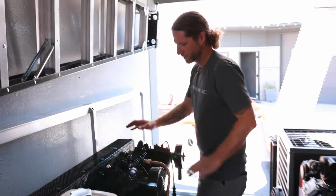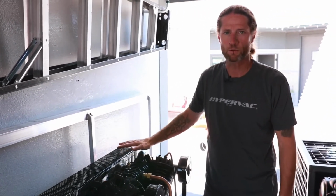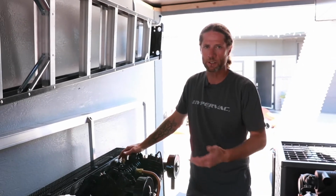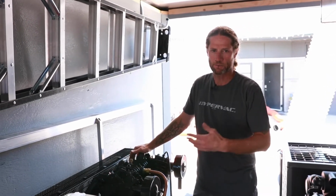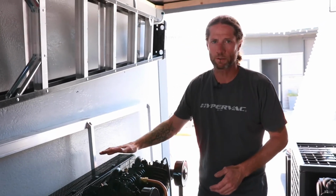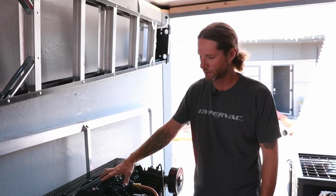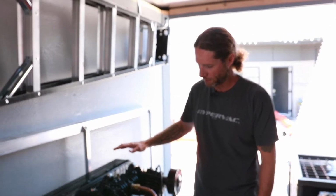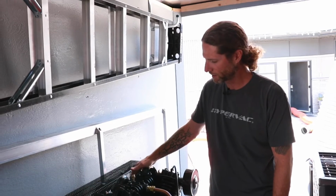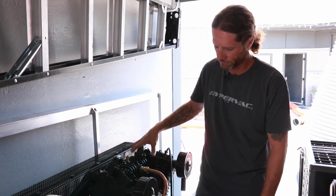Now on your compressor head, you're going to want to change the oil. I recommend doing it twice a year, every 6 months, typically at the start of spring and the start of fall. That way it's before both your busy seasons. You're going to want synthetic compressor head oil only in this. You can pick it up at Roll Air, those sort of places, auto parts stores, but it has to be compressor head oil for this one.